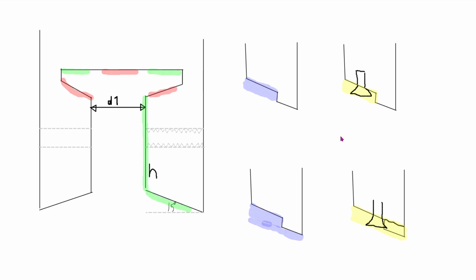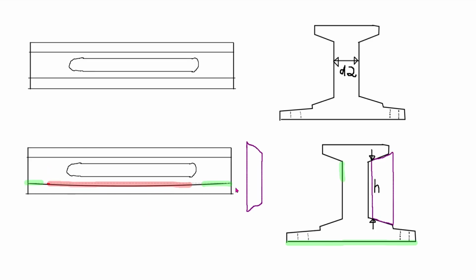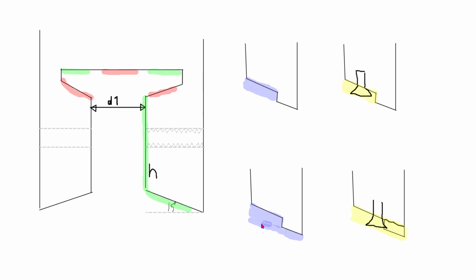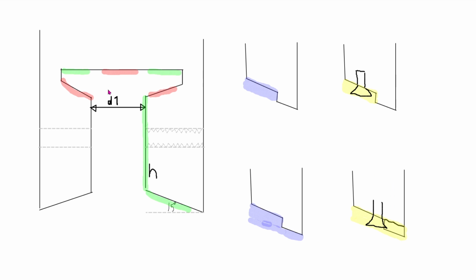For example, I welded this on in the first try. It didn't keep me that reference surface. I was stupid. I did this in the first try already, and then I noticed that this surface is no good, and it took me a while to figure out I could use that one. But I forgot to fix the static jaw, so I filed down so much I removed the good part, and of course it was sloppy again when I reached that area. So I had to weld a second time, build it up more, and then the second time I fixed the static jaw first and then put on the dynamic jaw, and now it's good.